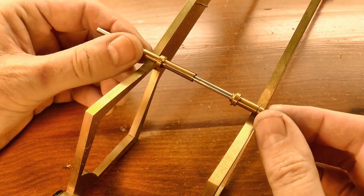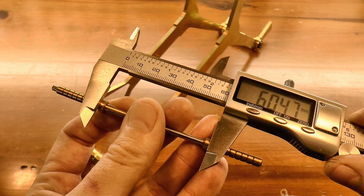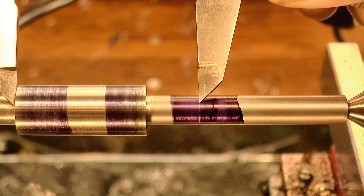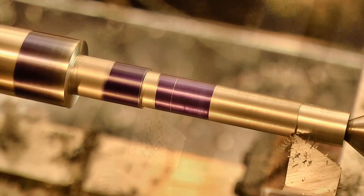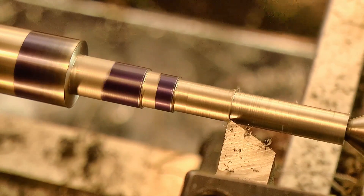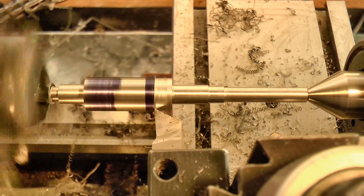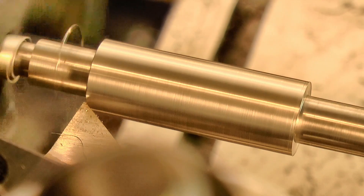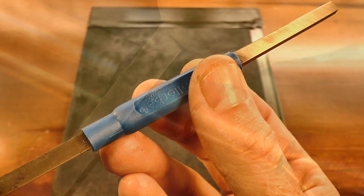I used the tool in a similar way to pick off the inside plate dimension. And at this point the shoulder dimensions are all in place, so I started on cleaning up the pivot surfaces, using this combination pivot file burnisher.